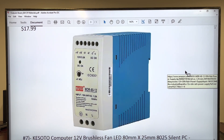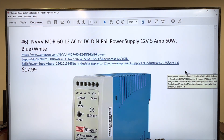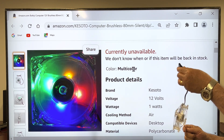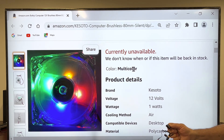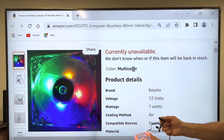A power supply — this one has a very good price. I've got another one; I prepared it already because I want to check the fans. We're going to be able to check both the power supply and the fans. Because the fans are driven inside by some transistors, you have to respect the polarity. As soon as you energize them, you should see them turning, and at the same time being driven by some LEDs. Now we check both the fan and the power supply — both of them at work.